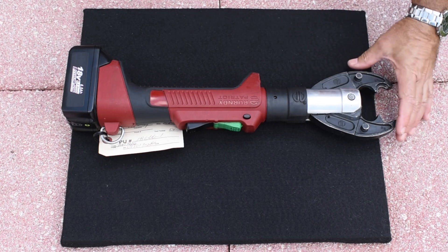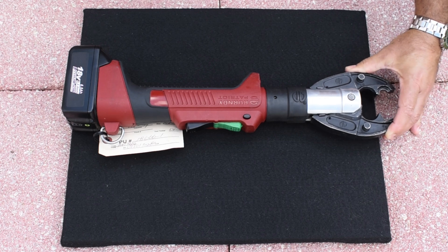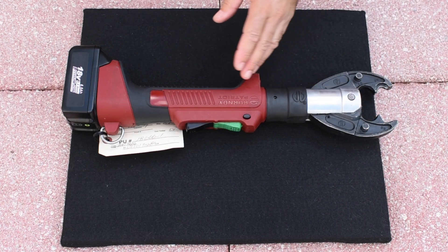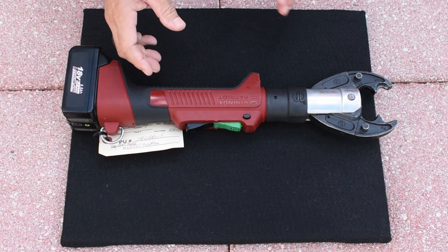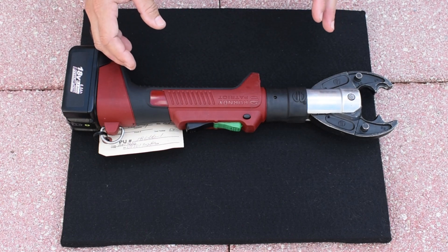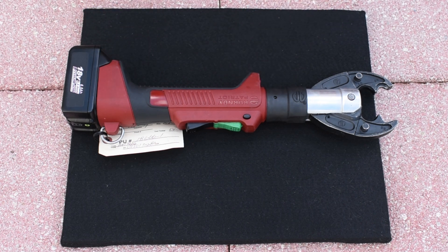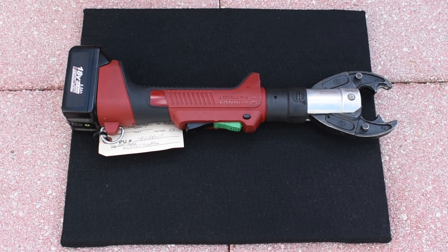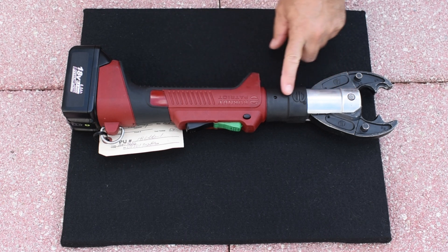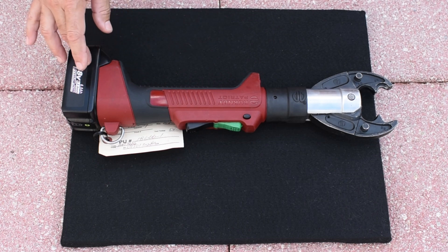When I got it, I noticed it did not fully close. It would start to go, hesitate, then go. So I knew it needed to be bled. I called up the company and they told me the process, but they said for this particular model you need a special bleeding apparatus to get every little air bubble out of the hydraulic pump. I didn't have it, I attempted to do it, and I only made it worse — it was closing less and less. So I found a company for only $90 that took the tool, bled it, changed the fluid, and inspected it. The whole cost for me was $115.